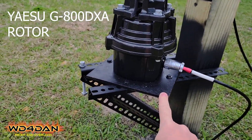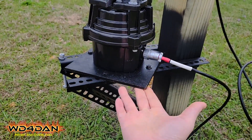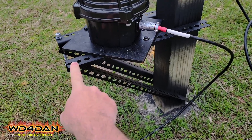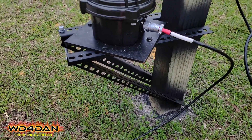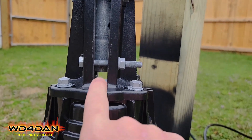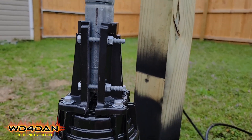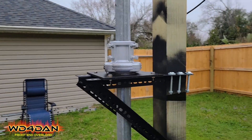Since there is absolutely no weight to speak of on this rotor plate, I can actually take this rotor out and this pipe will just stay right here. So the bracing here is not very critical, but I still use the same slotted angle to give it a good foundation. You can tell there's no weight on this rotor at all because the pipe doesn't even hit the bottom of the rotor — it actually stops right there. I can take these clamshells off of this rotor assembly if I had to replace the rotor, and the pipe would just dangle there, because all the weight is taken up by that thrust bearing.